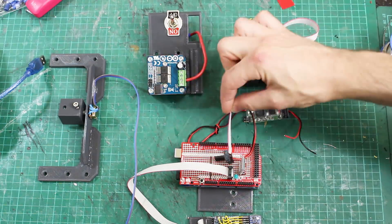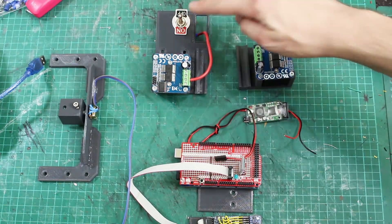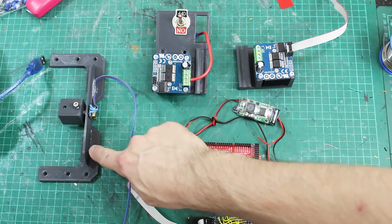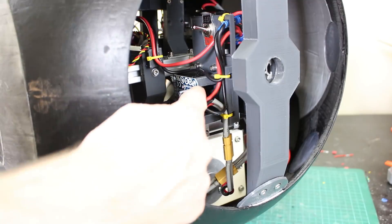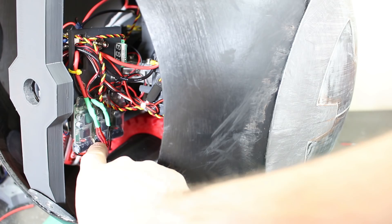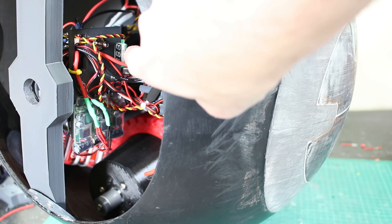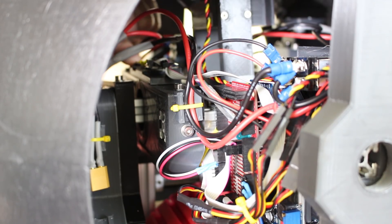We also need to fit connectors on the board for cables from the motor drivers. These fit onto the 20-20 back to back, and one has the power switch. We also need some regulators and another power switch for the servo power, because they need six volts, and we need to fit our pod assembly with a connector, and then fit it all into the board with some power distribution. On one side we've got a motor driver, and there's one on the other side as well. The Arduino is fixed on that side, and on the other side we've got power supplies that regulate the power for the servos — everything has power switches, and I've got a little display that reads out the battery voltage. The inertial measurement unit is just here measuring pan and tilt of the robot, so we can keep it stable.